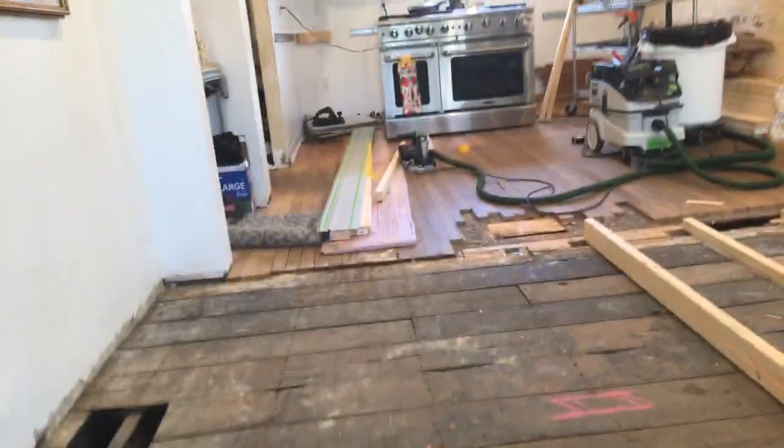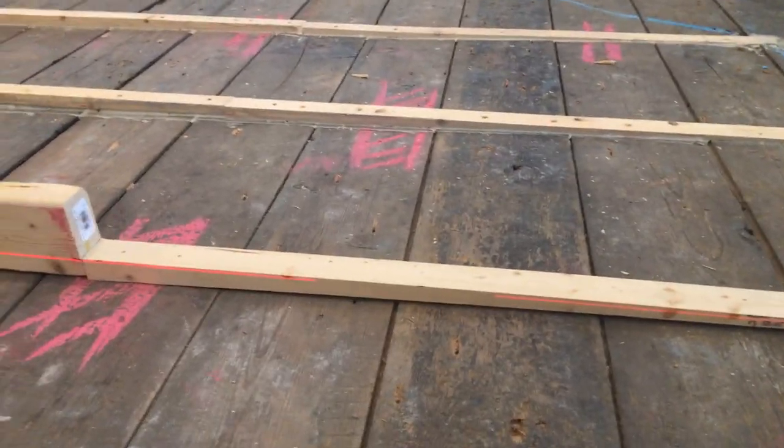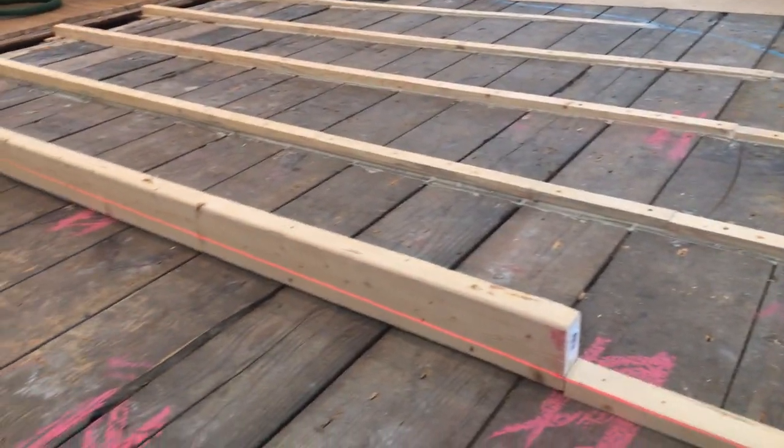If I need to, over there I've got a planer. And it's a little easier just to plane off a tiny bit of material than end up short and have to shim it up. That's what I found. Basically, that's how you create these long, thin pieces of wood.